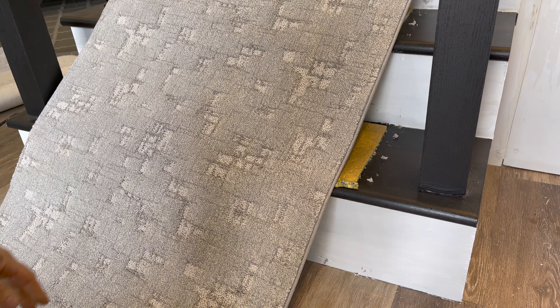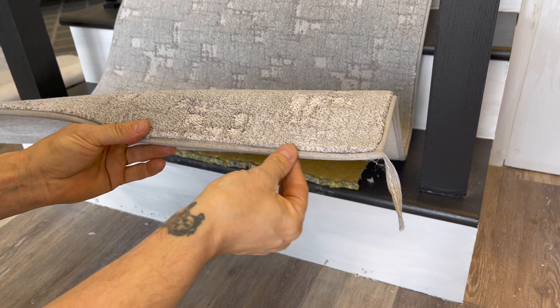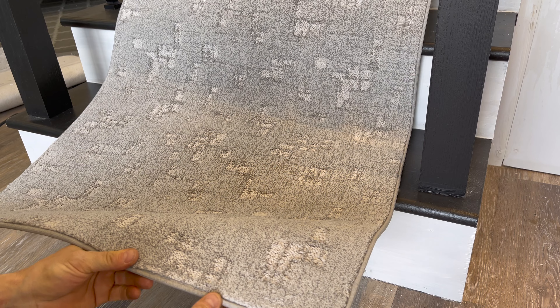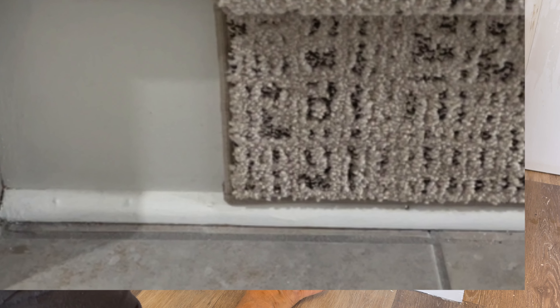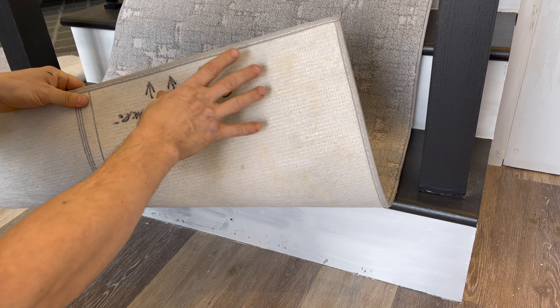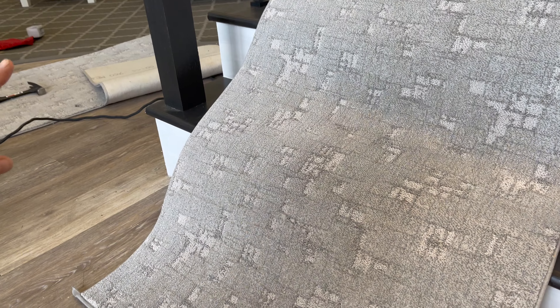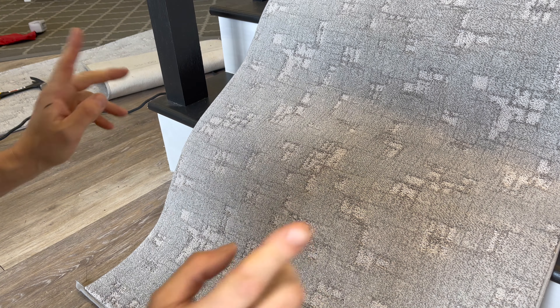Let's lay our runner up. This is 28 and a half inches. It's all sewn on the edges and it's sewn along the bottom. Now we want to line the bottom up on the floor. If you had a piece of quarter round under here, we would set it on top of the quarter round — it just looks better. We've got it marked bottom start here. That means the pile is running down like this, and this is the professional way to put in stair runner or carpet. We want to run the pile down, and that's why we write on there, bottom start here. So please follow those directions exactly.